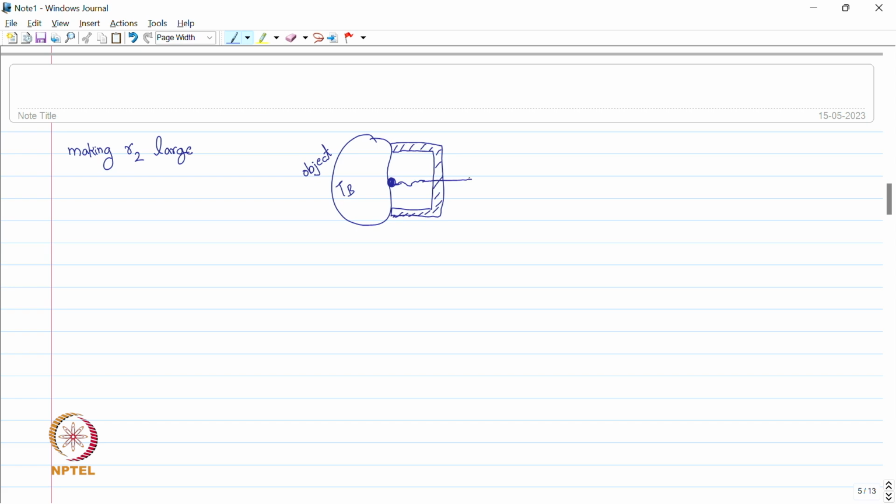Now this cable comes out from this cavity, and this cavity temperature is also being tracked through another cable, which goes to some instrumentation amplifier also. Let us say we have an amplifier coming in which is plus, and here it is minus, and then it is some sort of driver circuit, which is controlling this. So we have this cavity which is containing this sensor. The temperature of this cavity also can be controlled using this driver circuit.